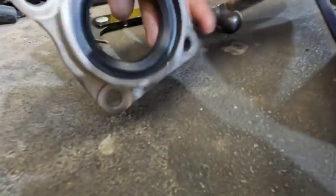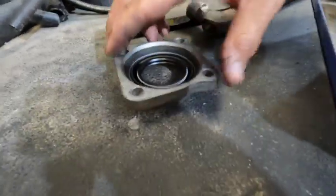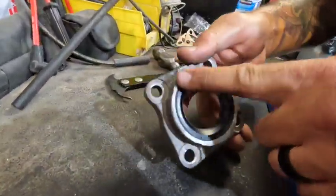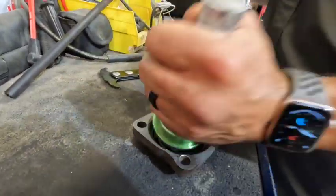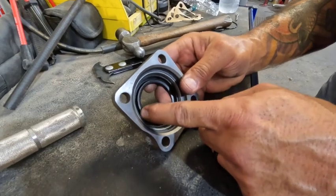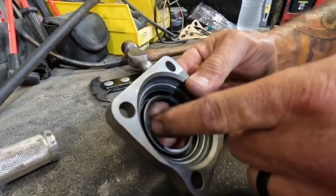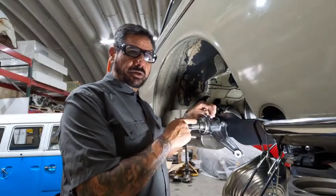Press that in until it's flush with that edge - you can see it's still recessed a little bit, so there's a bit more to go. The most important part of this seal is that inner spring right there, so you need to make sure it's on there. I'll push the spacer through to verify that the spring is still pulling that rubber inward.